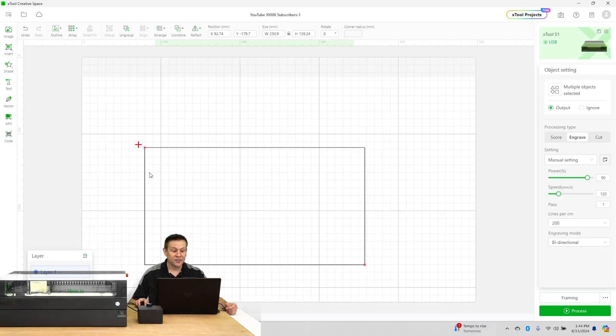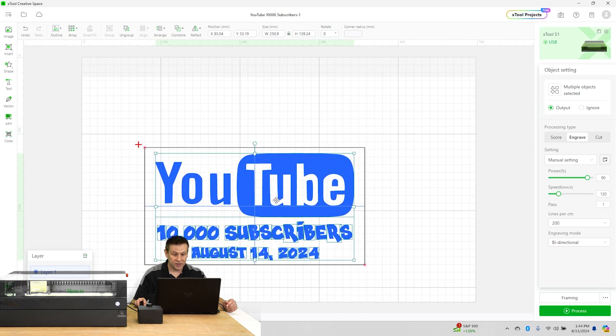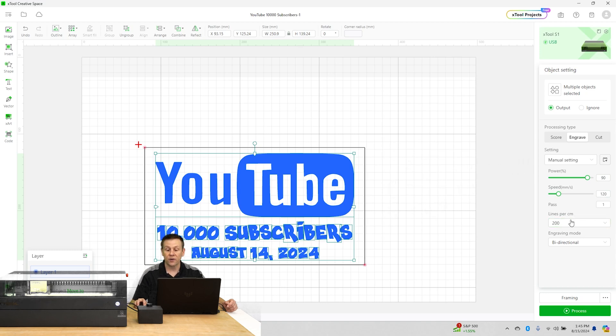Look at this — I have this nice box. If you're not familiar with X-Tool software, this box is the exact size and location of the material inside of the machine. This is why I love using the X-Tool software matched up to the S1 laser machine. When I pan up, we're going to see that I already have my graphic loaded in. I'll pull that down and get it squared up inside this process area, and it snaps into place perfectly centered on that work material. The settings I've already picked for the engraving: one of the key areas for success with the color infill is I need to be pretty aggressive with how deep I engrave — I want to be at least two millimeters deep, which is deeper than a sixteenth of an inch. The settings I'm trying are 90% power with a 40-watt laser module, speed fairly slow at 120 millimeters per second, and lines per centimeter fairly high at 200.